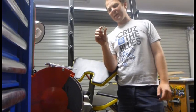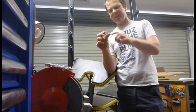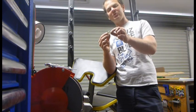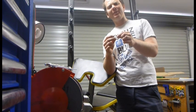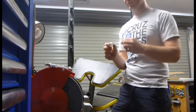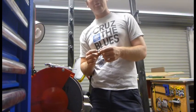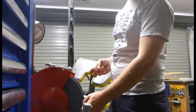Now there's another nut here. We're going to take it to the bench grinder and just take the ends off it, which goes against what you'd normally do with a nut. Normally you'd want them on, but it's got to fit inside the end of the cap just to give it a bit of strain relief. So we'll take the edges off with the grinder and go from there.